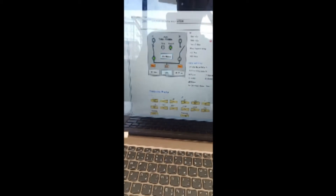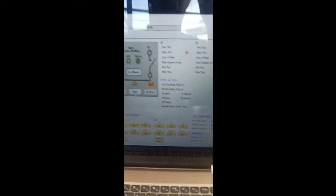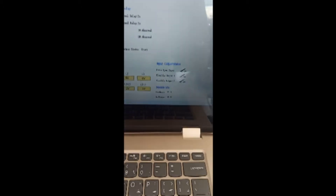In this module, the display shows the inside of the controller. We have voltage for normal and emergency, or QS1 and QS2. There are relay contacts inside the controller, status, and delay for parameter adjustment. In tabs 1 and 2 you can read what fault is present — over/under volts, loss of phase, wrong phase sequence, over/under frequency — these are warning, fault, or shutdown faults.